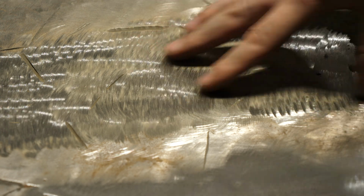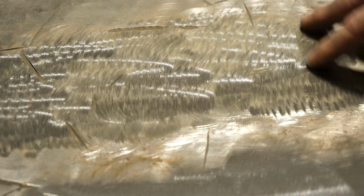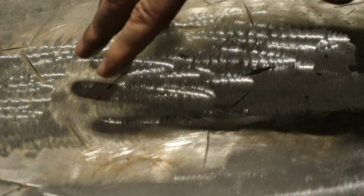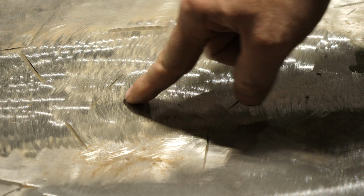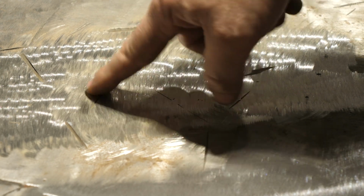Well, part of it is I'm an idiot and I was kind of doing things a lot wrong to show you. But part of it is hard rocks take a long time to grind something flat like this. They're really designed for material removal fast and not really for surface grinding on something like this. Now, the problem partially is that wheel's not broken in, so it has such a small contact area that it just wants to grind on a small edge.